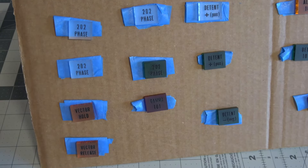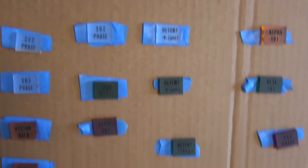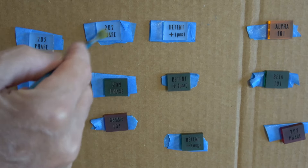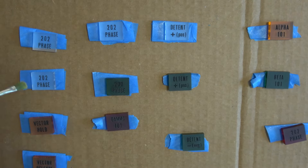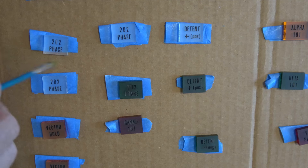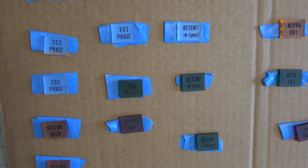If you're not going to do the frosted look, then you do have to clean it off. Then you want to hold it up to a light — I have Craig's light box here with an LED. What that does is show you if you missed any black in any of the letters because it's hard to see. Once you've got the sanding done, blow it off with a little air, then take a soft dry brush and brush out all the letters to make sure there's nothing in them, because sometimes it'll look like it's missing a little bit but it's just white grit from the sanding. Once you have them all cleaned up, I do one extra step not in the video: I'm going to do a crystal clear coat on this. That's going to bring out the black, make it pop, and give a nice coat on the surface so that if you're making them active buttons, the oil from your hands won't get into the letters and wear them out over time.